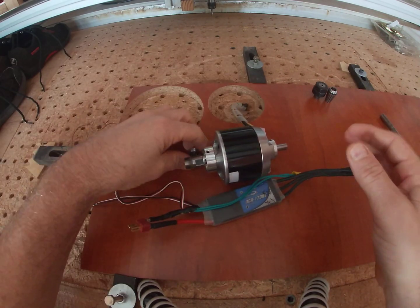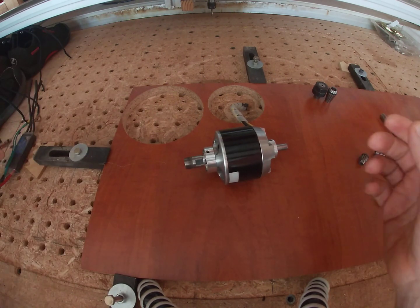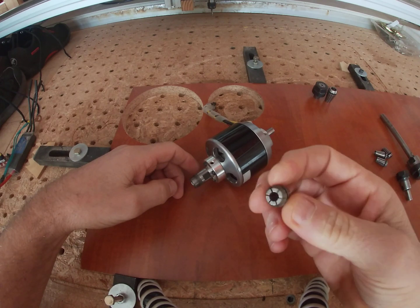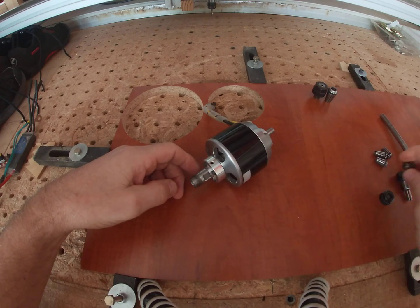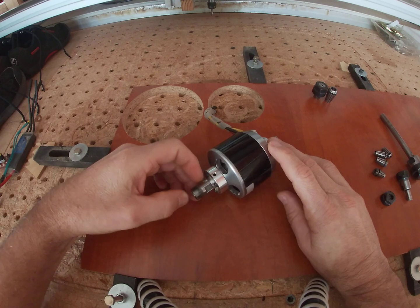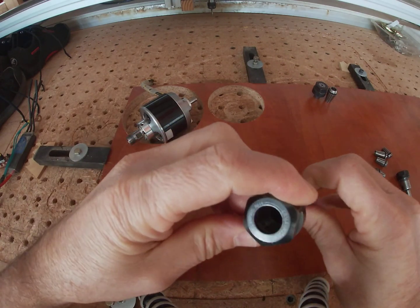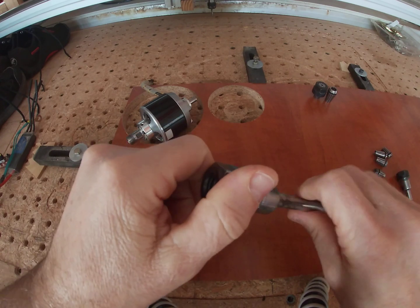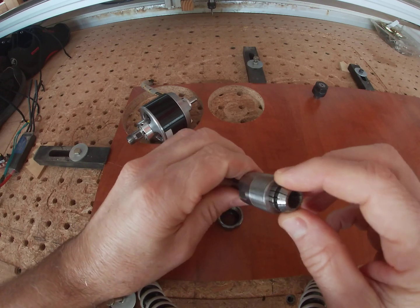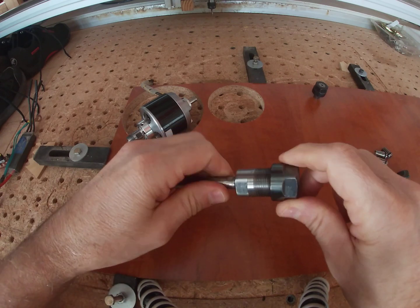This is the initial setup I had, and the problem with this kind of setup is you're limited to the end mills you can put in — I think you can only go up to a 7mm end mill with the ER11 and that's it. So what I did — I had two of these motors — I modified another one, replaced the bearings, and ordered an ER16 chuck. This one can take much bigger end mills, so now I could go beyond 7mm, which is all I needed.